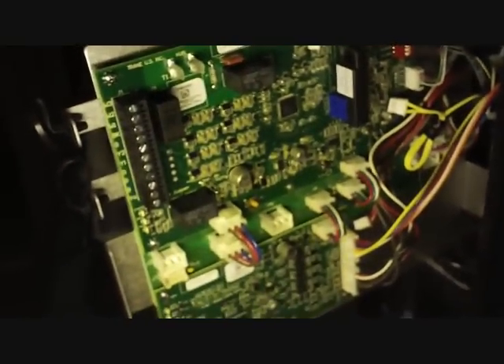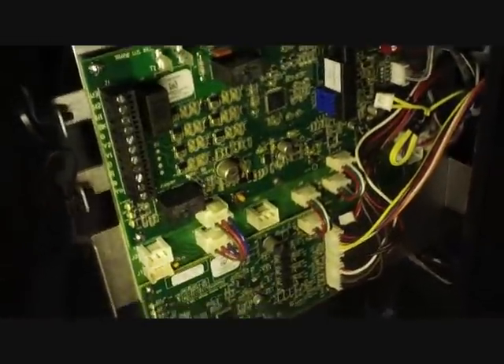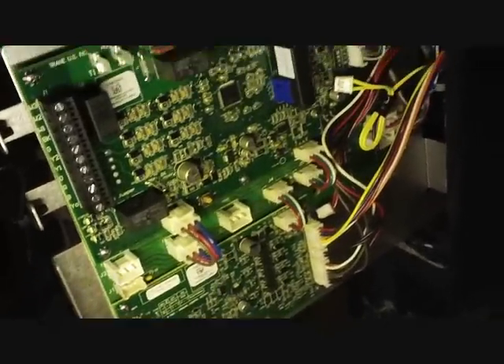There's a little drain tap over here — pull it out. Here's the main board; let me get the light around here so you can see it. As you can see it's very large. The low voltage connections are over here in this area, and then it controls the EEV and airflow and things like that. It's quite a bit to set up on a variable speed air handler — there's a little bit more to it on this one.